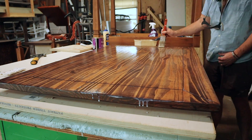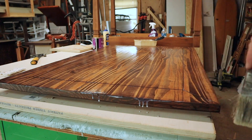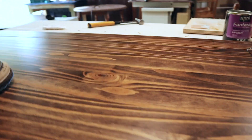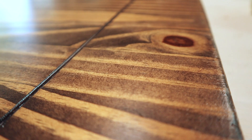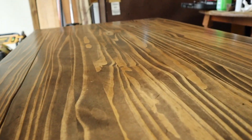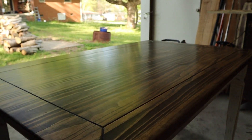This is post — I think this is the third coat. I have the Rotex up there and it's looking okay. I ended up scuff sanding one more time and then swapped finishes completely to Helmsman water-based finish, which I'll do a second video on later. The reason being I couldn't get the bubbles to leave. The final image from the last coat of polycrylic still had some bubbles tracing in the brush strokes. Post Helmsman: fully buffed out at 220, two coats of Helmsman water-based finish on top of about three coats of polycrylic.